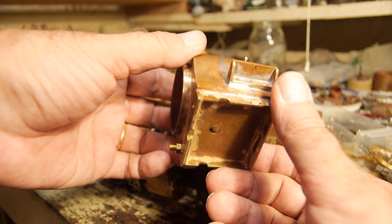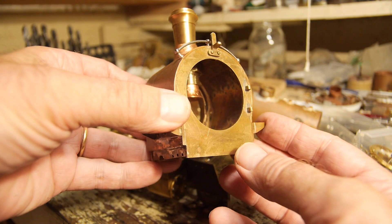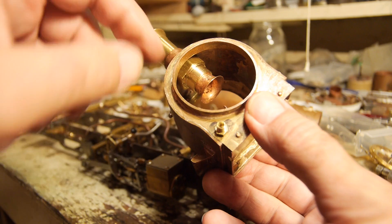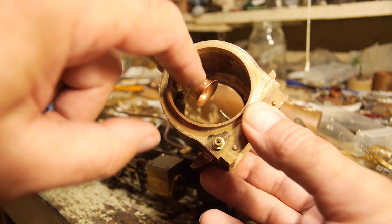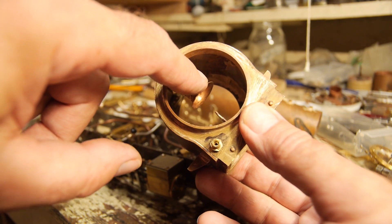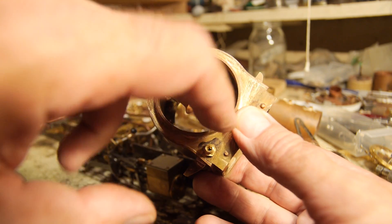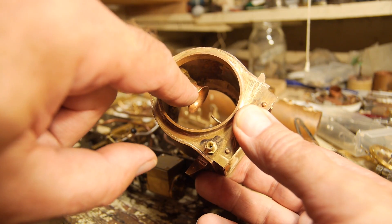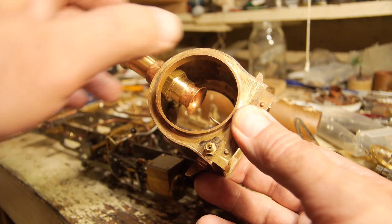This is the smoke box. Inside you can see the chimney and a cowling here which is called a petticoat pipe. On some small coal-fired engines they miss out the petticoat pipe, but it's pretty important because it acts like a funnel that gathers all the smoke coming back through the fire and gives it a better course. Without a petticoat pipe, you'd just have a sharp edge with no gathering surfaces.